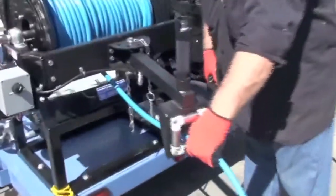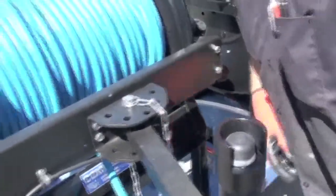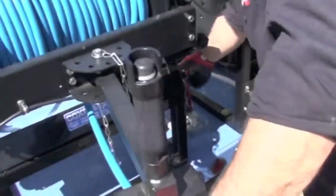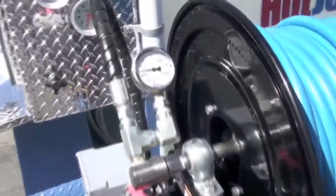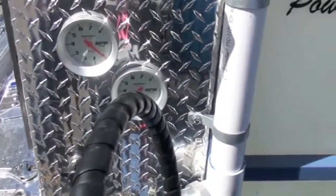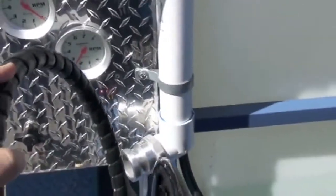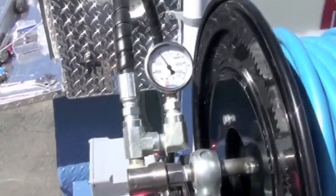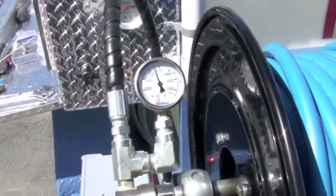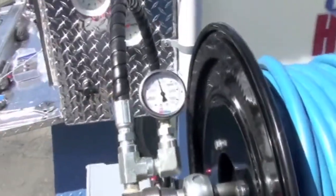You want to hold on to your hose here — you're going to turn on your valve. That engages it. Turn off your easy start here. Now you can adjust your throttle up. You've got your pressure gauge maxed out at 3,500 PSI and 3,000 RPMs.